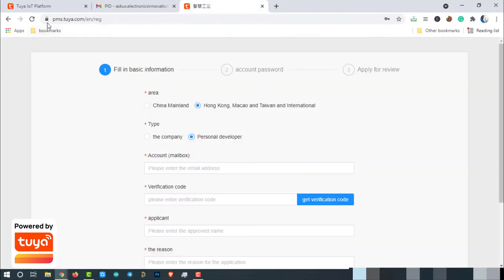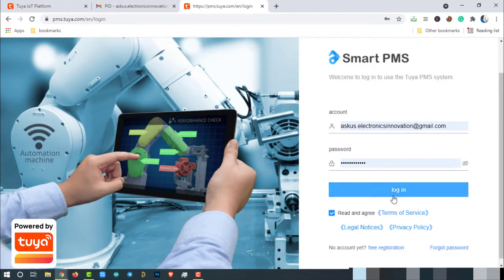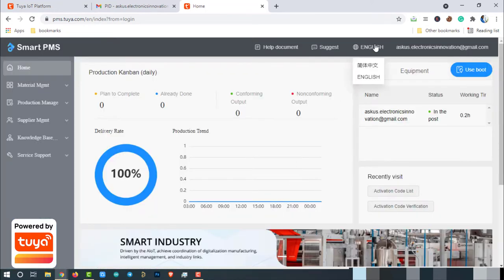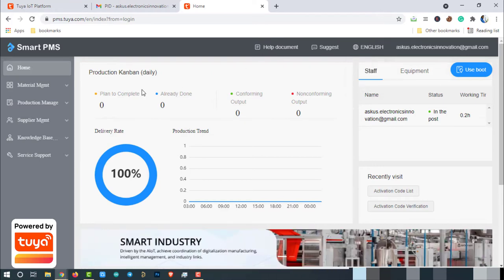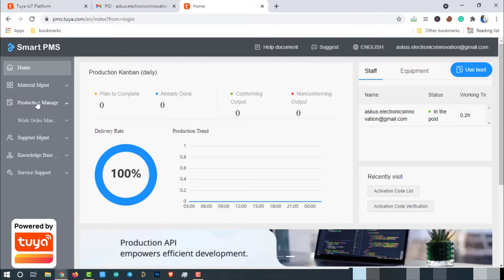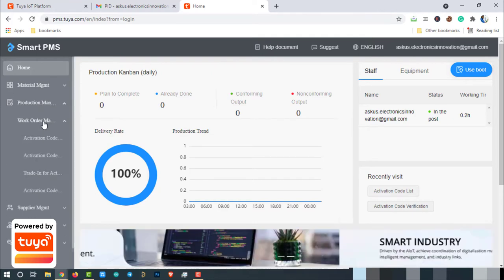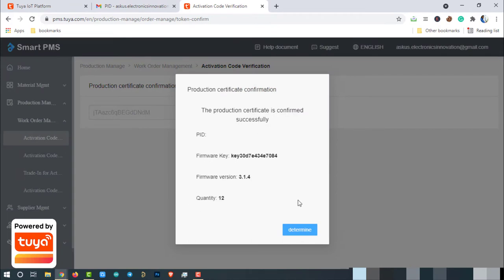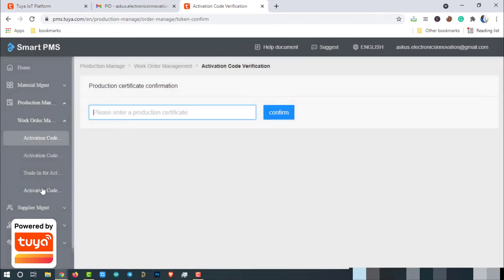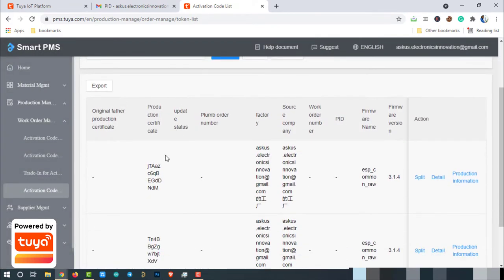Then visit the Tuya PMS platform using the link provided in the description. Sign up by providing all required details. Then log into the platform using the same credentials. If you find the website in the Chinese language, you can change it to English from here. Click on Production Management, Workorder Management, then Activation Code Verification. Input the token ID that you have just received over the mail from the DevOps team and confirm it. You can find the activated code list in the following menu. That's it, the token has been activated successfully.